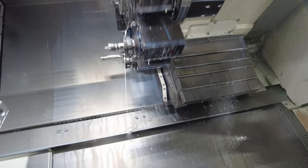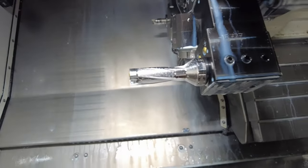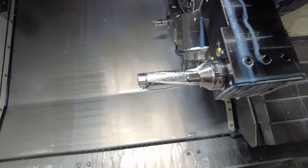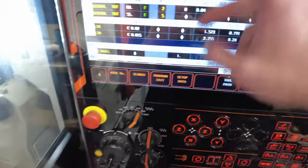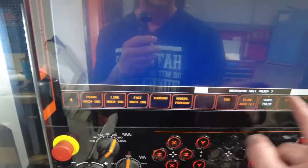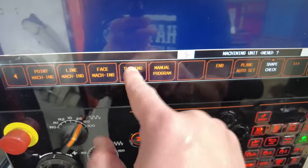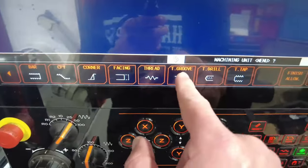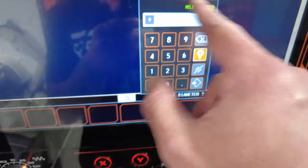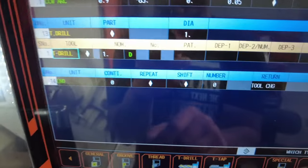What I'm going to do is make a quick video showing you the differences. This is a one-inch indexable insert drill. I'm going to write a quick program to show you the differences between different options. So I'm going to insert a new unit, go for turning — T drill, turning drill. Hole diameter: my drill is one inch, so automatically it will apply a one-inch drill over here.